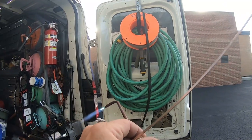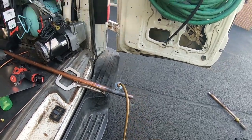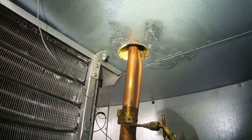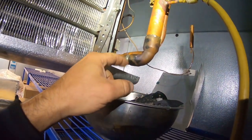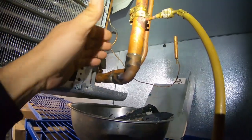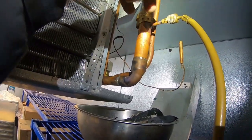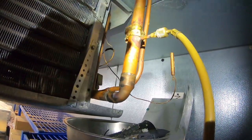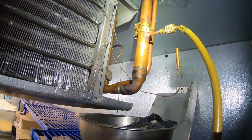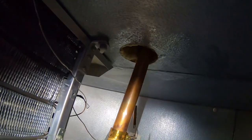I was able to run nitrogen right through there while it was being brazed. That'll give us a place to pull our vacuum. We've got our purge going on right now. Got our new pipe in there - I cleaned all that nasty plumber's solder completely out. Now we're able to purge nitrogen through. The top of the half-inch line is open so it can vent through. Got to put a magnet on the solenoid yet so it can fully flow through. Got everything wiped off and cooled off.